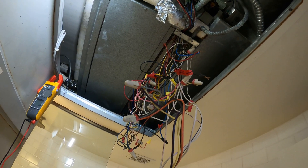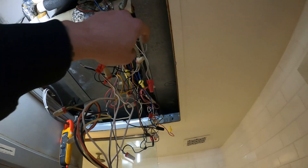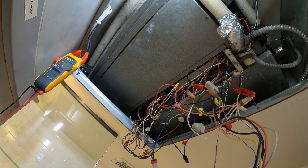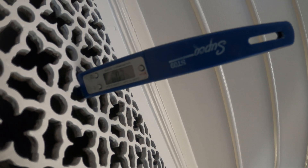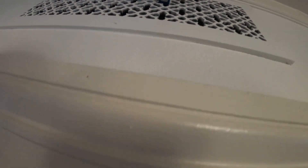I'm going to put the cooling wires back and put some straight power to the heating relay and see if this thing heats up. If not, we're going to need some new heaters and a whole rewiring job here. Let's close up the panel — we're at 60 degrees and dropping. We got the cooling actuator working. We have a faulty heater and to get to the heater you've got to get to the top of the unit, which we can't access right now, so we'll figure out a solution. Probably replace the unit but we have cooling for now. We have 55 degrees supply air and dropping.